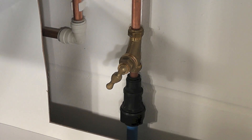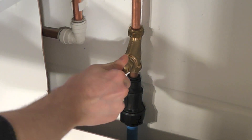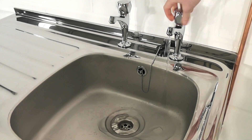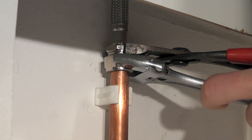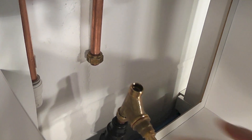The first step of the installation process is to turn off the rising main to the house. This then allows you to drain any excess water from the system. Now the system is drained, the old pipe work can be undone, cut and removed ready for the new pump.